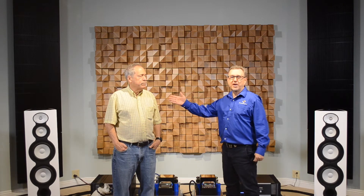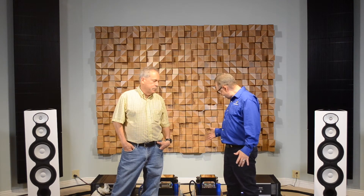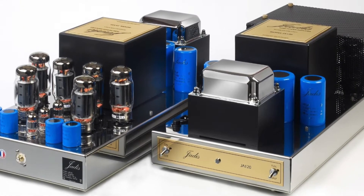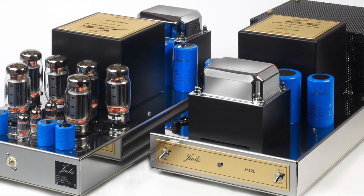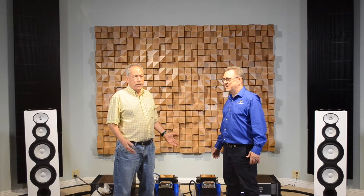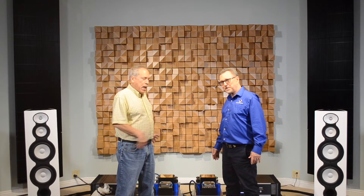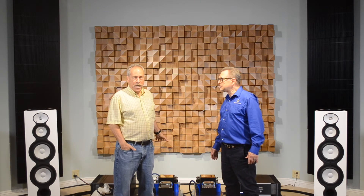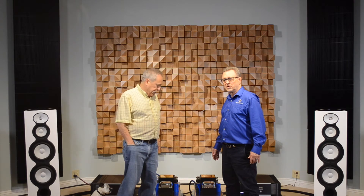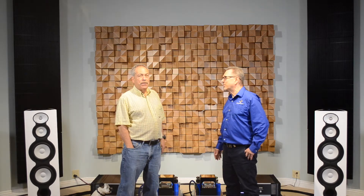I'm here with Tom Carrione, our service manager. Tom, you're familiar with these Jadis amplifiers, particularly the JA120 — what can you tell us? Well, I've never had one of these fail, so they've been incredibly reliable. It's a complete package — power supply and the whole output stage is one nicely done monoblock. The output transformer is potted so the core never touches the chassis, which reduces eddy currents and distortion. They've really got their act together on that, and this model sounds better than some of the earlier ones.